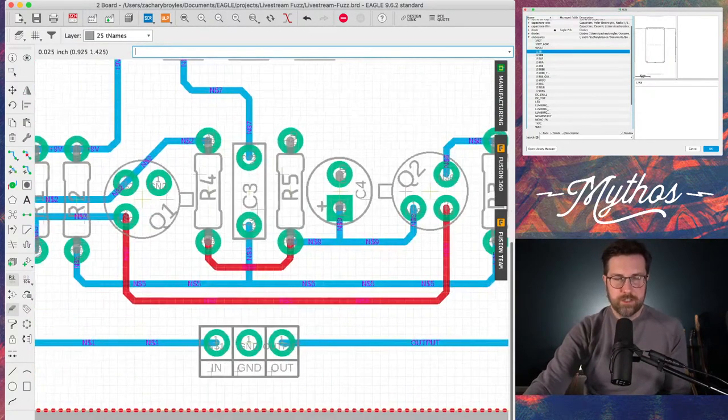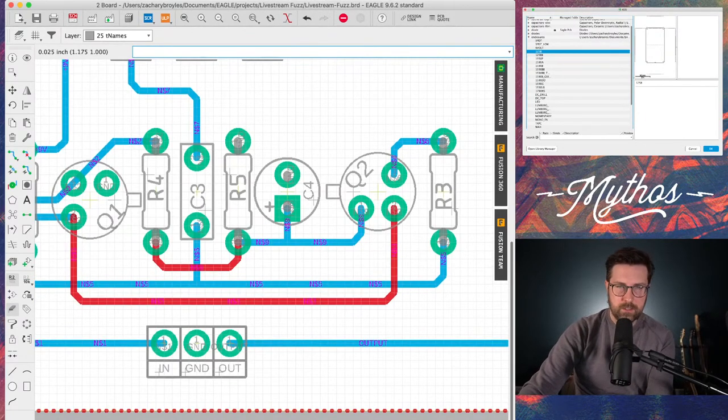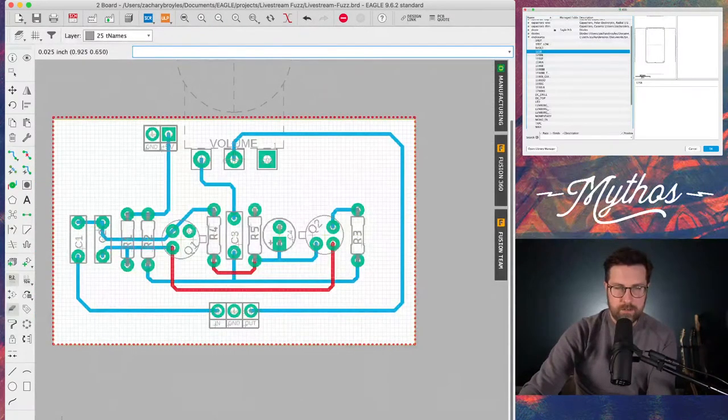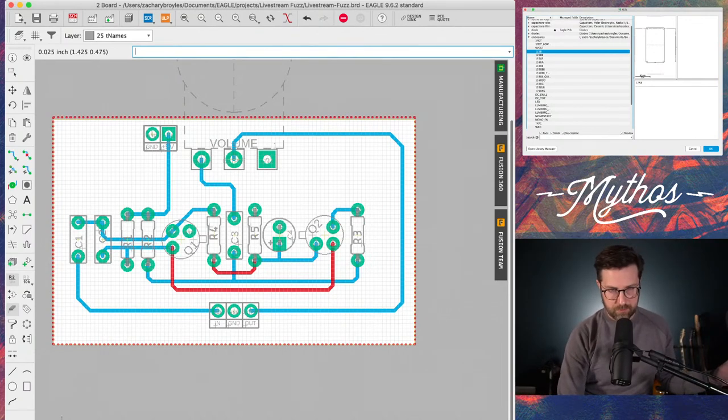Well, this is assuming you go as rudimentary as possible. So literally, the only pad connections I have on here are the in, the out, a ground to go to your foot switch, or anywhere really, a ground for your DC jack and the 9-volt for your power jack. You can totally add as many connections for a switch as possible. You can use a header. Some people have a supply library that will have things that are already labeled for LED and all that stuff. But this is just for bare bones. There's not even an LED connection on here, no LED resistor.